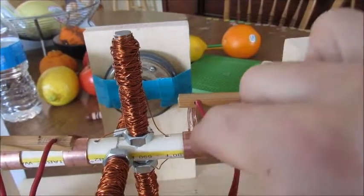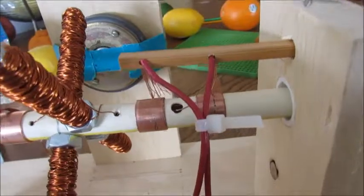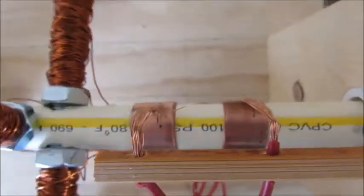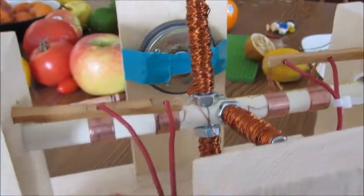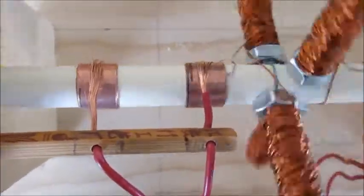This coil right here goes into a hole, through the tube, and comes out to the other slip ring, because you don't want anything impeding the brush. When the brush is touching the slip ring, you want good contact. It's just frayed copper wire — heavy gauge with a lot of individual wires making up these brushes. My brush holders are chopsticks; I drilled holes through them to hold the brushes touching the slip rings.